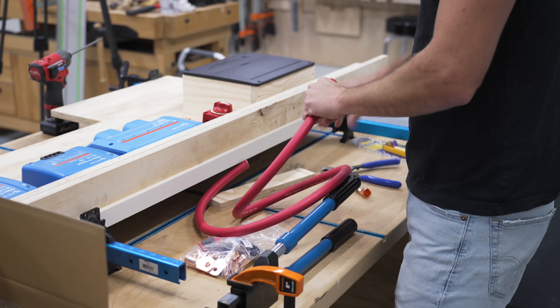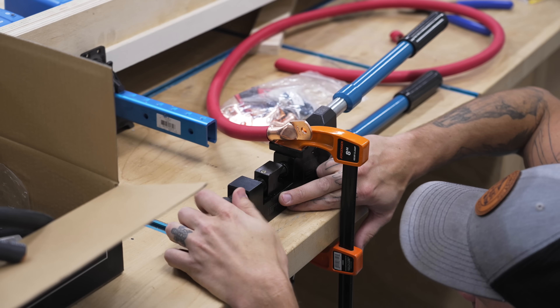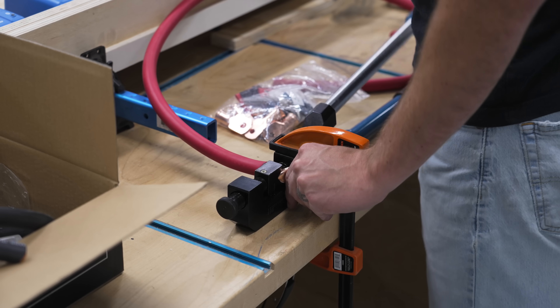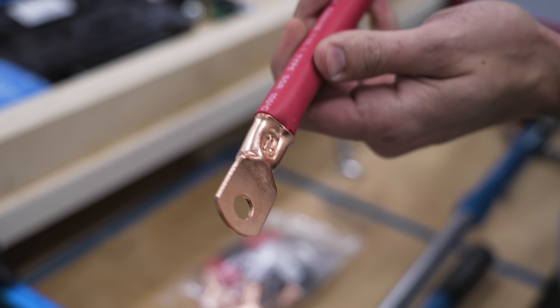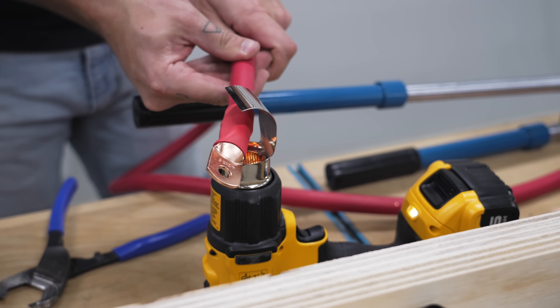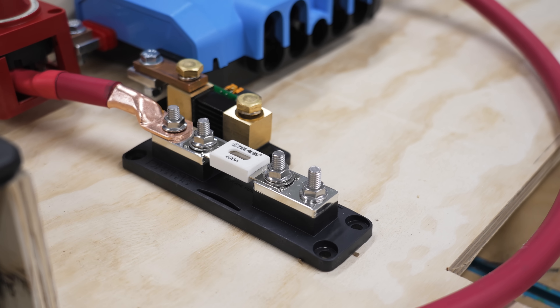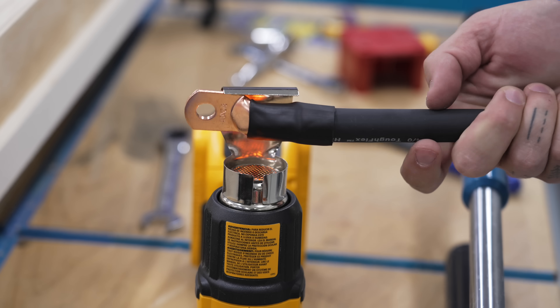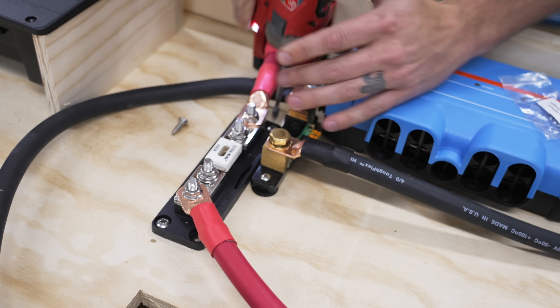For this we needed to make up our first of many cables. We were using 4-aught cables, and these things were absolutely massive. After stripping back the sheathing, we needed to crimp on some wire lugs. The amazing thing about these crimpers is the force applied actually cold-welds the lug to the wire, meaning they are permanently bonded. After crimping, Nate added heat shrink to shield the back half of the lug. He got the wire bolted to the disconnect switch and figured out where it needed to terminate at the fuse block. Next up were a pair of black negative cables — one connecting to the battery bank and the other the chassis ground. Once connected, Nate got these components permanently screwed to the plywood panel.